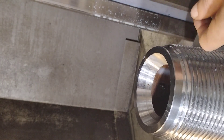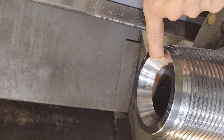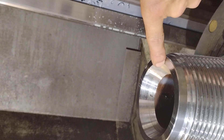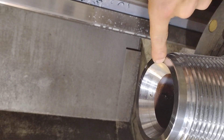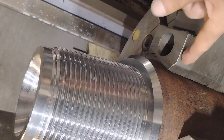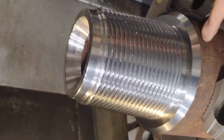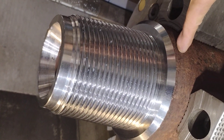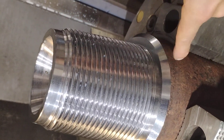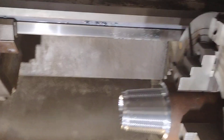They don't want the mud to shoot out. The mud is at high enough pressure that if there's a small crack or deviation right here, it will seep through and eventually cut through it like a pressure washer — cutting all the way through this entire chunk of steel. This is seven and a quarter inches in diameter and it'll cut through it like a hot knife through butter. Once it starts to go it's just like a pressure washer. It's called a washout. Anyway, on to the next one.